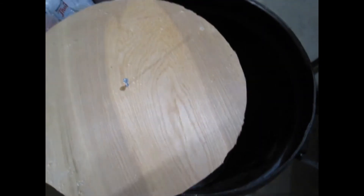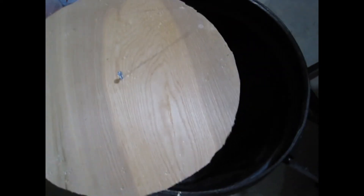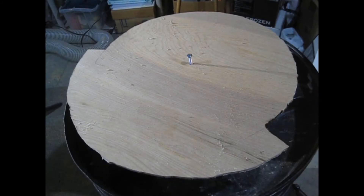Measure how much clearance the elbows need, then add about an inch and get the diameter of the bin at that depth. I cut a piece of 5mm flooring plywood and stuck a screw in it as a temporary handle. Invented by J. Phil Thien to solve this exact problem, the Thien baffle removes about one and a quarter inch off two-thirds of the disc. Thien did a lot of study to fine-tune his baffle. I just hacked out near two inches of the edge because I don't want to spend a lot of time or effort on this.